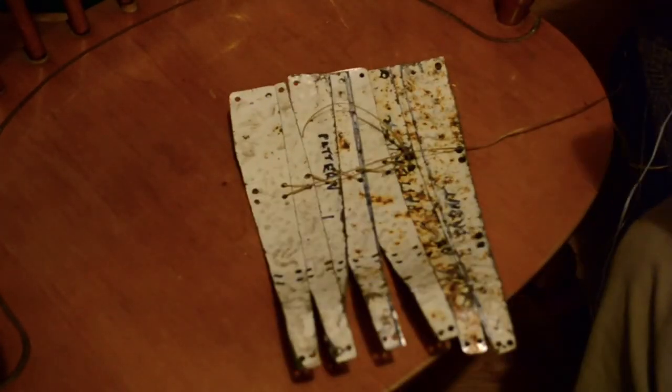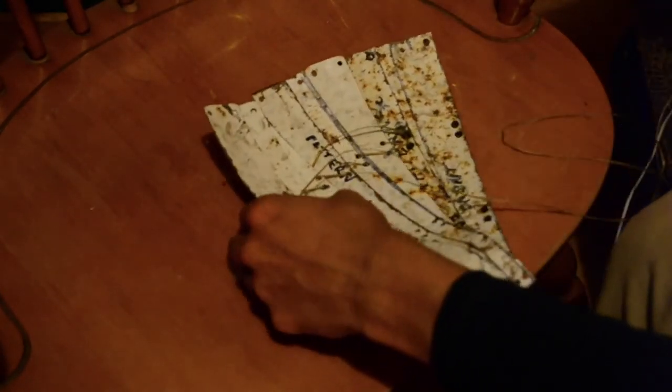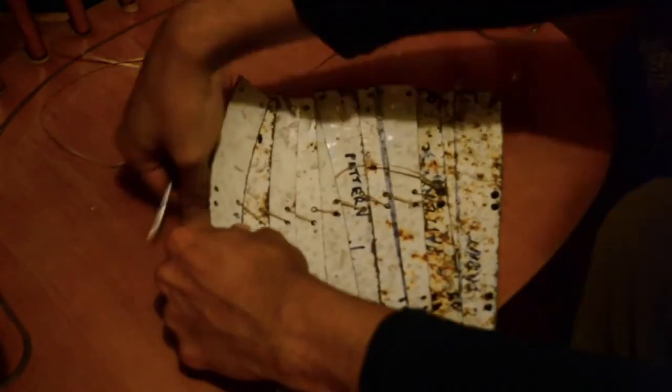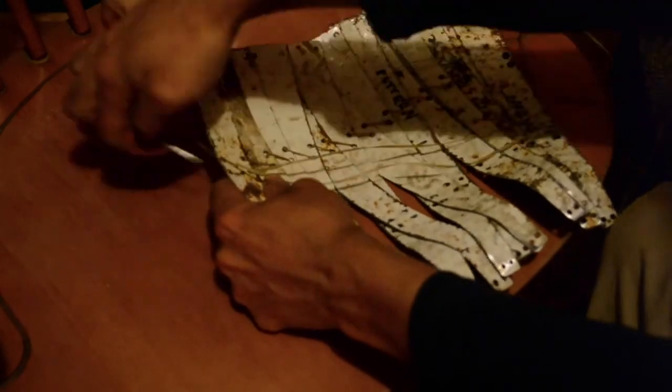I don't know what this style of stitching is called, but it's fairly ubiquitous for lamellar armors. On the outside of the armor you stitch vertically, on the inside you stitch diagonally. Once you reach the end of a row, you turn around and stitch in the other direction. On the finished product, the stitching on the inside should look like a lot of little X's lined up.